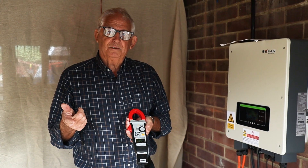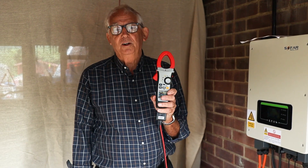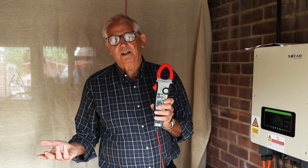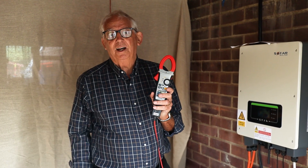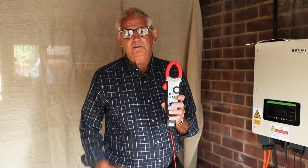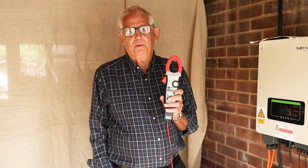I need to do the insulation resistance test, but I need to do this open circuit voltage test first before the insulation resistance — because obviously if there was a break in the cable I'd only be doing half the test. So we know now we can safely move on and do the tests properly.